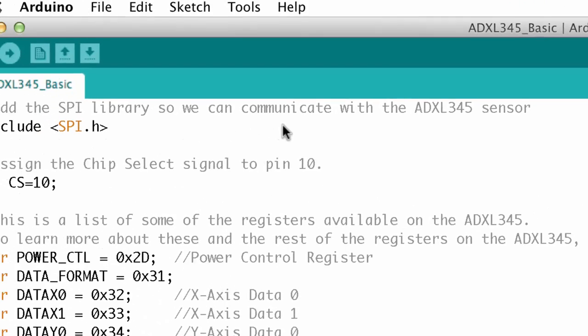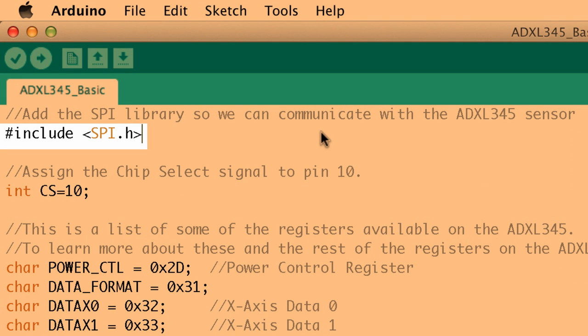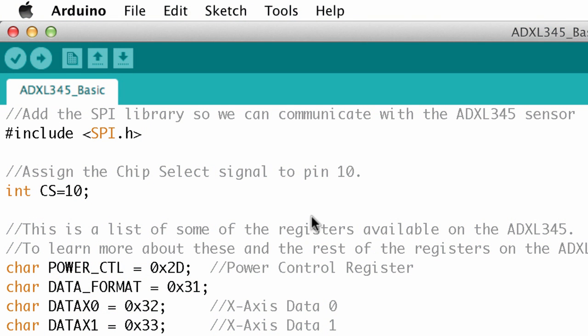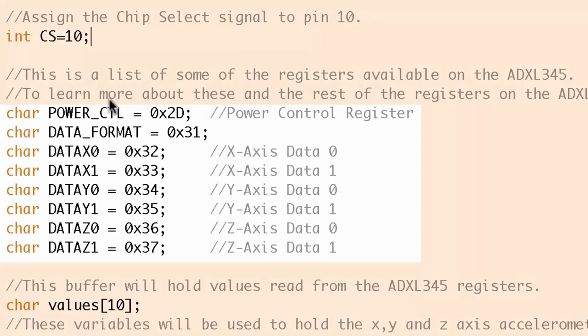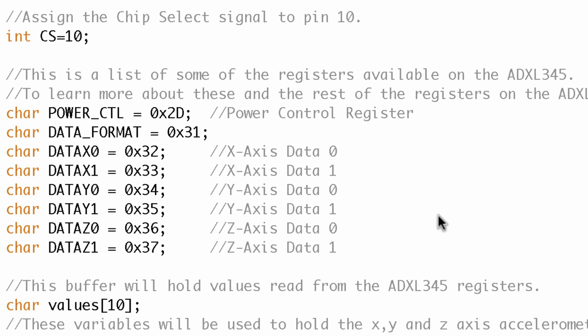The data is pretty straightforward, so let's go back into the sketch and identify what we do know. Luckily they did a great job commenting the code. That first line - include SPI.h - I know they're including a library; it's a communications protocol. I'm not too familiar with SPI but that's fine. The next thing they're doing is declaring and initializing a variable called CS - chip select - set equal to 10. Then there are all these constants declared; I'm not sure what they're all doing, and it says to read the datasheet.